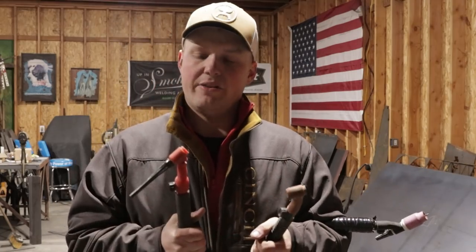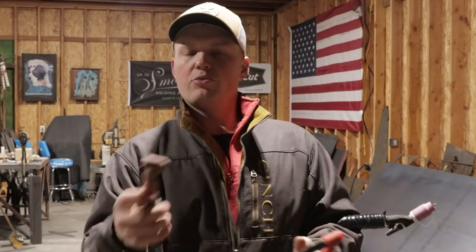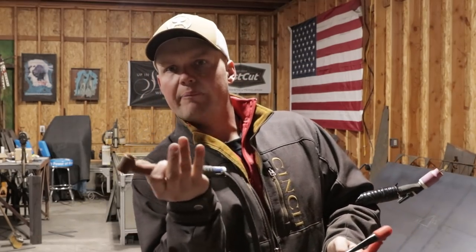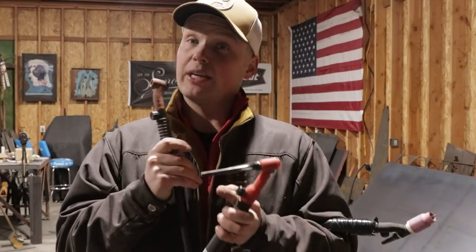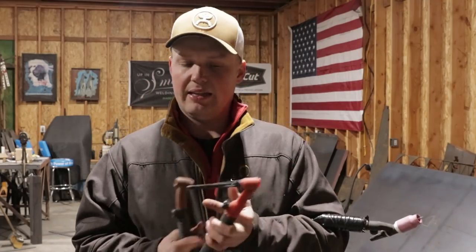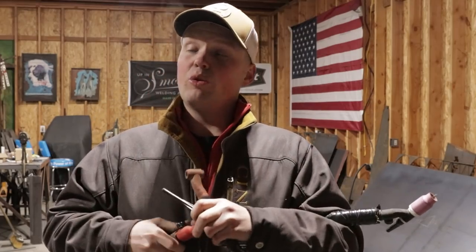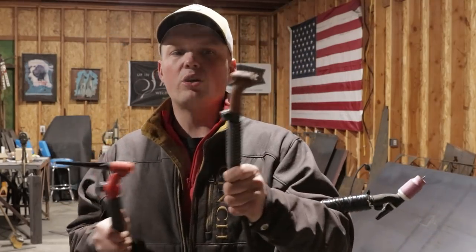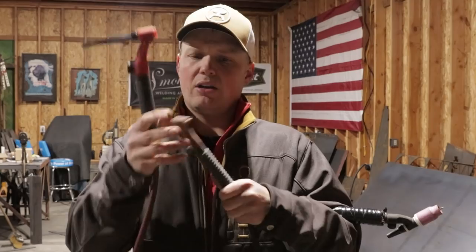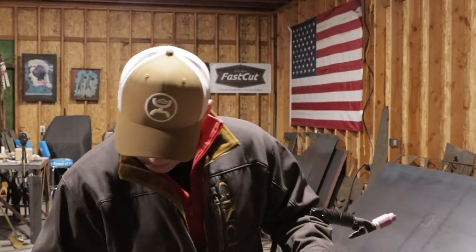Now, the big advantage of a flex head is if you're going to walk in a freehand bead, you can move this thing wherever you want to get up underneath that and then just walk that bead in, and it's super comfortable. Now, you can get these flex heads about anywhere. As far as a structural TIG welder, I would recommend a flex head. I think they are awesome. You can reach into places. You can do all sorts of stuff with a flex head that would be very difficult to do with just a solid head. Both the Heavy Hitter and the Miller Torches have flex heads. So all you've got to look for when you order one is flex head, and that's what it's talking about. This thing will move in all sorts of directions. Whatever you need, right? So, that is that.